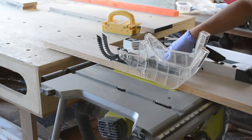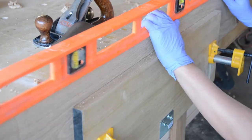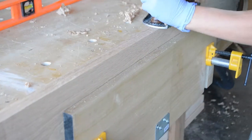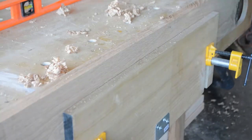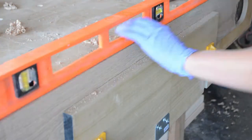The edge I was referencing wasn't quite straight, so I clamped the board in a vise and planed it flat with my hand plane, checking periodically with a straight edge. This is my first hand plane — I got it recently on Craigslist, took it home, cleaned off the rust, sharpened the blade, and it works pretty well. I use it all the time.